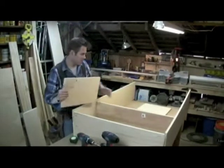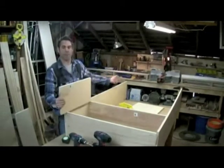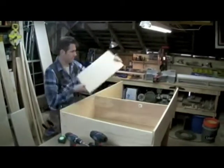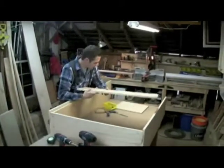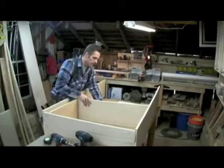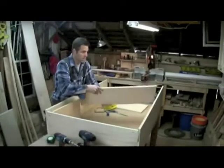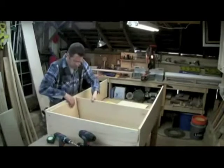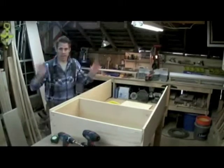That's for the shelves down here. This would be the space for the upper shelves. Now, the one thing you want to make sure is that when I drive screws, I don't want to drive it away from my spacer - I want to drive it towards. So this is going to be my upper shelf. I drop it right in place, flip my shelf over, and make sure these pocket holes go to the front for our face frame because this is our back. Now my spacer is in here, I run my screws in, and that locks it into place.